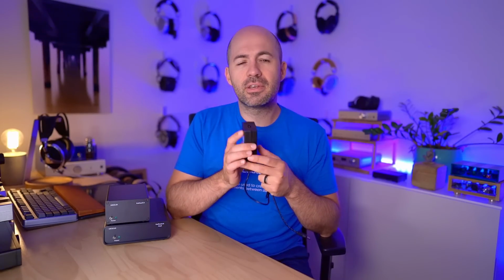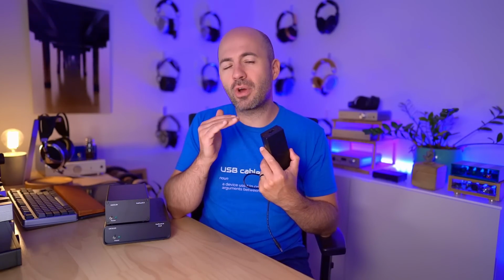And that is that inside these devices, you've got a transistor or maybe a few transistors that are operating in a way where they're switching on and off rapidly to reduce the 240 or 110 volt incoming power down to an operating voltage that suits your device. It might be 5 volts, 9 volts, 12 volts, whatever it needs to be. In contrast, when we look at the linear power supplies, these use a wire-wound coil to take that incoming voltage and to drop it down to whatever the output voltage needs to be. And so both are actually doing the same job, they're just doing it slightly differently.